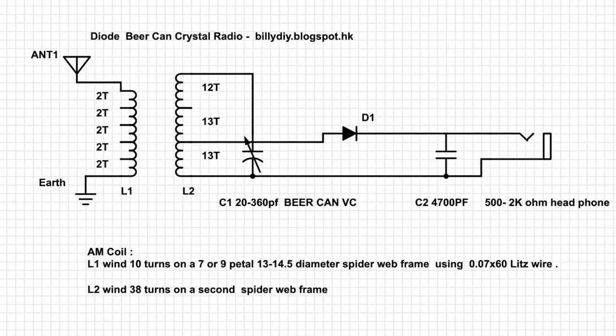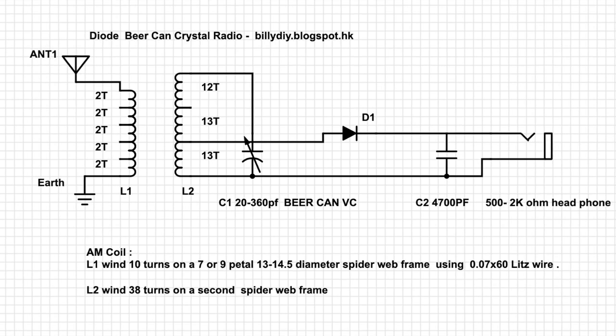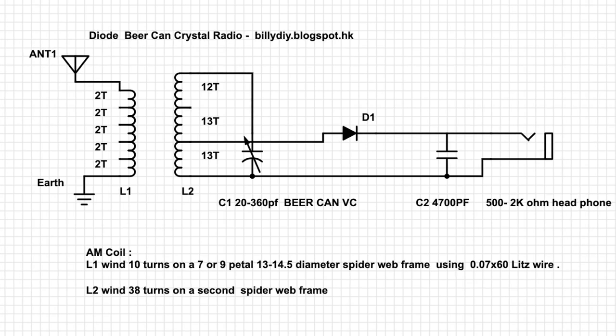This is the circuit diagram. The main circuit has two coils. The first coil is the antenna coil L1 on the left. You have to create tappings every two turns and try out which tapping works better for the channel you are tuning to. The tuning coil or resonance coil is L2, total of 38 turns, on a spider web frame